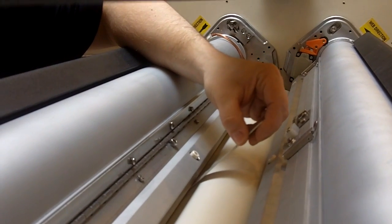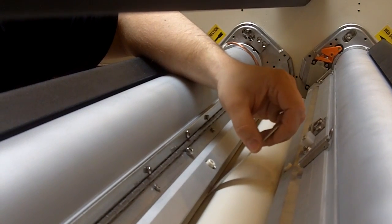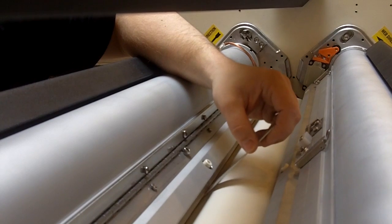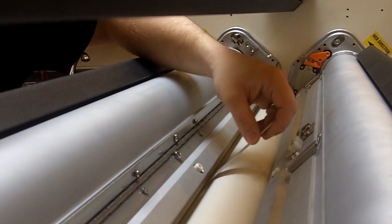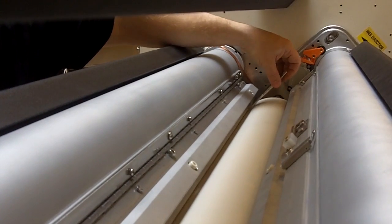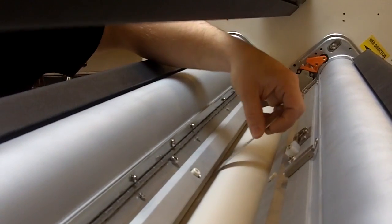In this example of a good electrode gap, you can see that the gap gauge slides in halfway — not through both electrodes, but just through one electrode. It slides in easily, it's snug, not too tight, not too loose. I'm going to check the reference of the electrode gap down the remaining width of the electrode assembly, and the gap looks very good there.